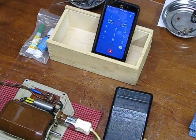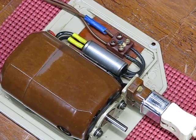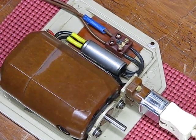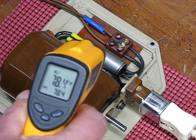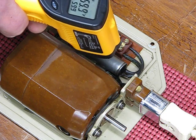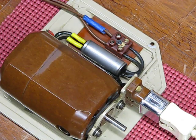If you're running a motor that has not been optimized by me and a foot controller that hasn't been optimized, you are missing the boat big time, folks. Let me flip the screen around. Top of the motor: 78.4 — and that's after five minutes of continuous operation at absolutely peak speed. Now this capacitor on the back — that should be hotter than blazes — it's only 59.9. That's the difference that my optimization process makes on a motor and a foot controller.